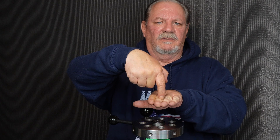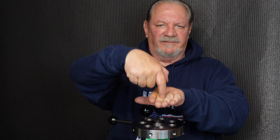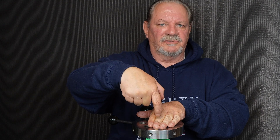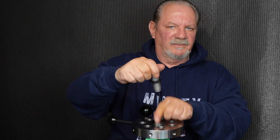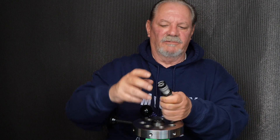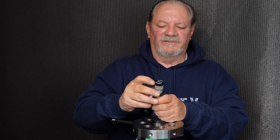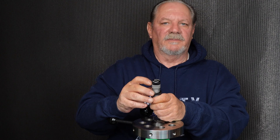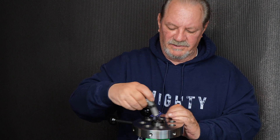When you're decapping, when the pin makes contact with the primer it's going to push the shaft up about ten thousandths. After the primer comes out the pressure is relieved, the spring rebounds, pushes the shaft down, and the primer is flicked off the pin — so you're not going to get any pullbacks. That's something we designed almost six years ago; about six or eight months after we started we developed that primer-flicking spring design into the cap.